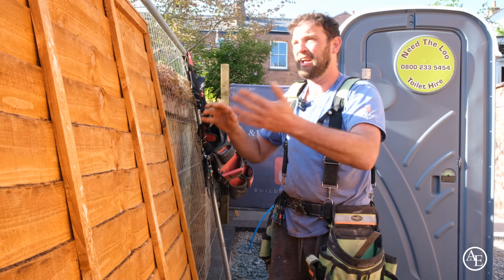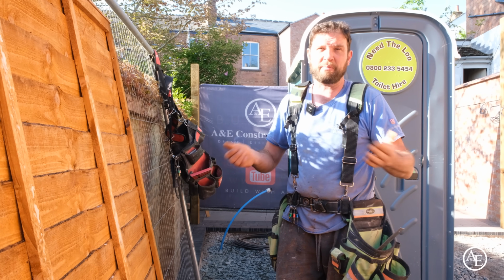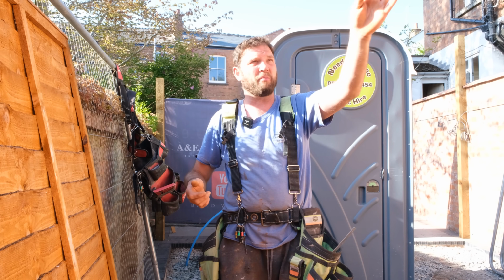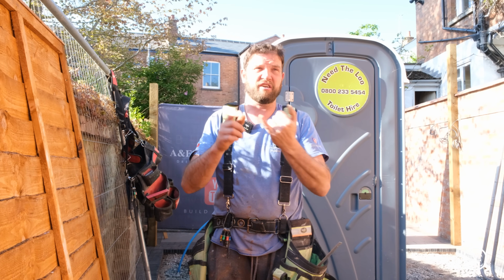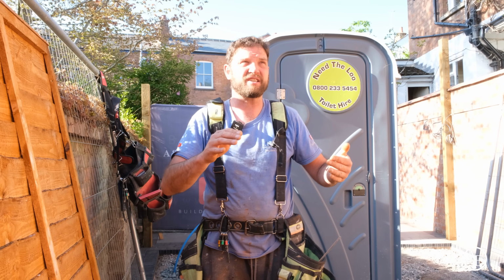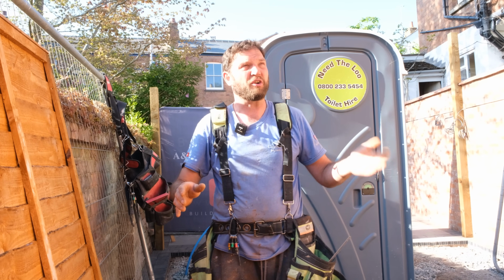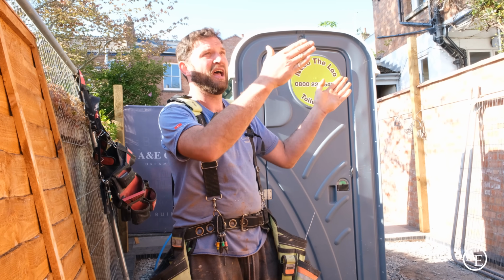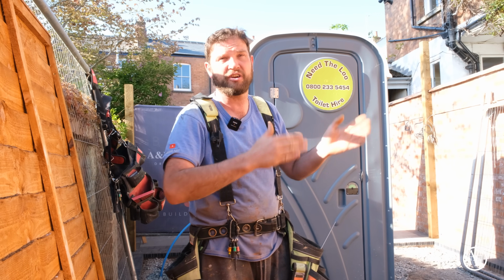and they alternate. Obviously, unfortunately, when you mass produce something, there's always going to be room for error. So what we've done, I've set my post to the bare minimum because I wanted a nice tight fit. But unfortunately, because of bows and this overhang, I'm just running the track saw down it to make sure that everything's nice and true. So I've got a good starting point. Also, I think that this is good practice, so that when I'm actually making a piece to fit in, I can get an exact measurement, because I know everything's going to be a nice straight line.